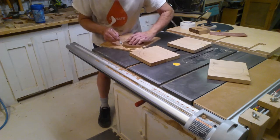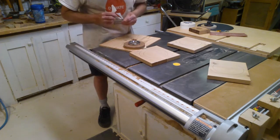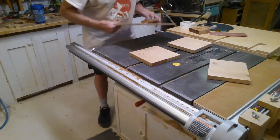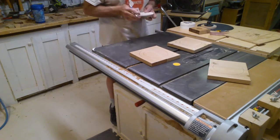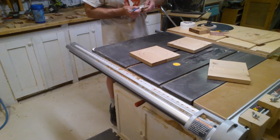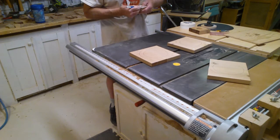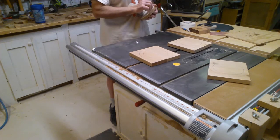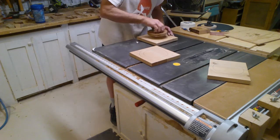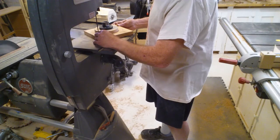Once that's done I have to remove the outer layer of the tape. I use my X-Acto knife to get right between the two layers and get the sticky part out. Usually I just lift them all up just a little bit — I don't take one totally off until I'm all done, then I pull off all three. I get them on my board, find my five-and-a-half-inch mark, get it centered — doesn't have to be perfect, but I want to get it somewhat right. I give it a little press. Now over here I'm cutting off the seven-and-a-half-inch edges to make it easier on the lathe.